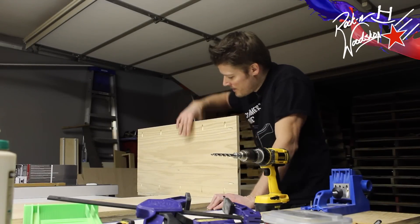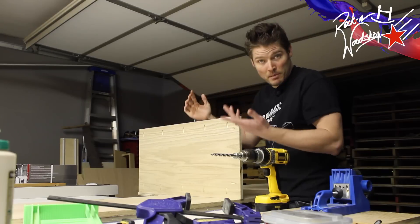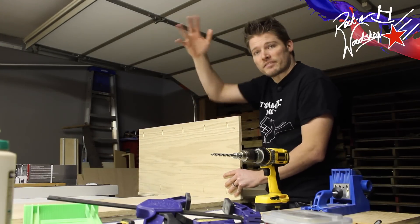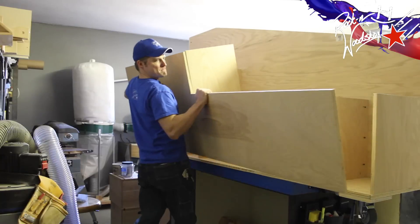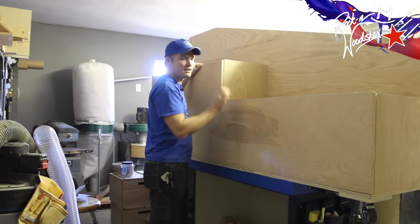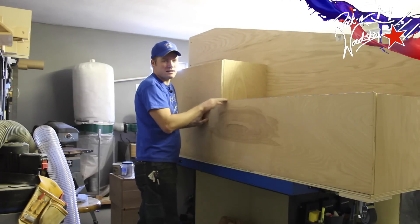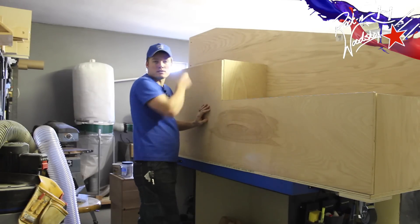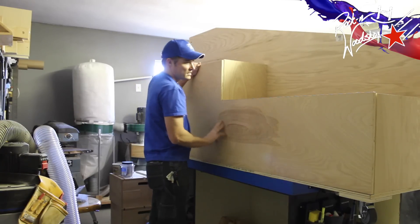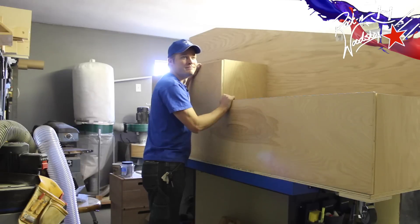Now because I have this certain section of the face that's got to be flush with this particular upright and it's kind of bulky, I'm going to go ahead and attach this upright to the face and then take the face to the cabinet. There's the front face. As you can see, this cutout is the exact same as what was on the end — I didn't show you how to cut this because it was all the same, just apply the same thing. So now I just need to screw it down.